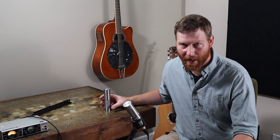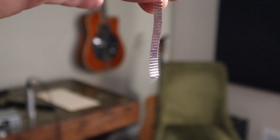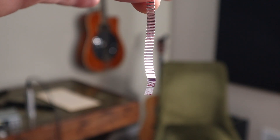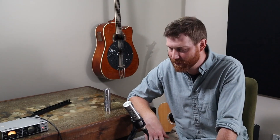And I'd like to explain why. So to start, let's talk a little bit about the aluminum in a ribbon mic. You can see a little sample here, and you can get a sense of how light it is when I blow on it. The aluminum used for ribbon mics is incredibly fragile. We can make it thicker, and it makes the ribbon more robust, but there's a huge drawback in sound quality. Those ribbons are out there with the thicker foil, but that fragile ribbon is really desirable for the most important aspect of the mic: the sound quality. So the challenge is, how do we take that really fragile, beautiful, sensitive aluminum ribbon material and make it as robust as we possibly can?